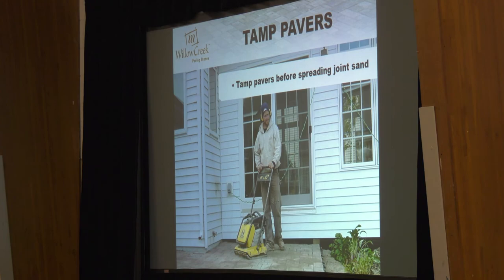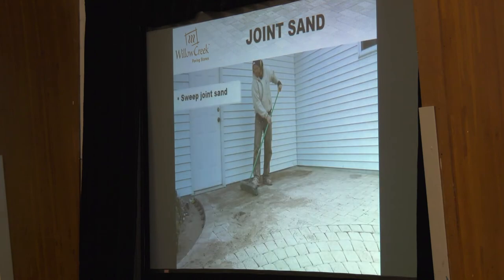This drove me nuts when I first started installing pavers — you're telling me I'm going to get it perfect, spend hours on my base, spend hours screening sand and laying, and then run a plate packer over it? But the plate packer takes any abnormalities — any uniformity issues where one paver is sitting a little bit higher or lower — and smooths everything out. It also seats the pavers into the bedding sand so they're going to have less tendency for horizontal slippage — they're not going to want to slide around because they're bedded into that sand really nice and firm.